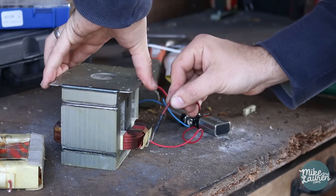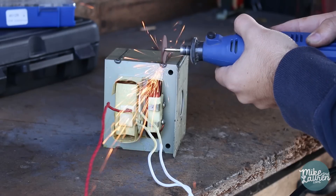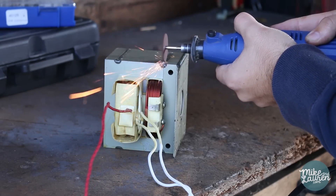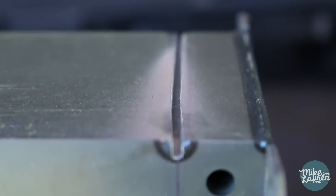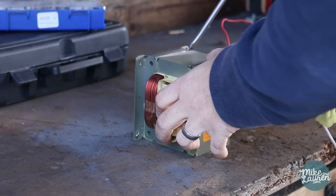For an electromagnet, just remove the secondary coil entirely — as soon as you let off the power, it drops. To remove the coil, you can either chisel it out carefully or cut through the welds of the iron core. I chose the second option. Most people really struggle with this, but I got really lucky and mine just popped right off.